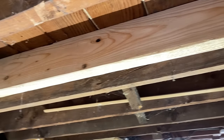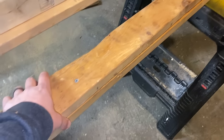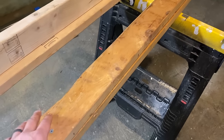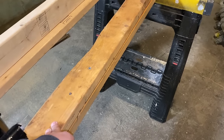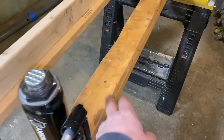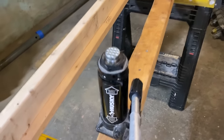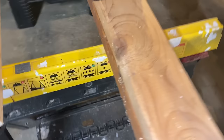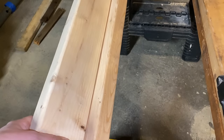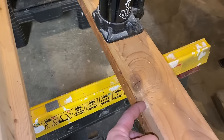So now I'm just going to get it out of the way so we can do a couple other things before we put it in there. What I have here is some pieces I'm going to use to hold up this joist. This would be handy if you were trying to correct a sagging joist. I'm going to basically put this on the floor, measure from here to the bottom of the floor joist, and then put this board on here and support it in the middle. I screwed these two 2x4s together, but this is a better approach if you know you're going to have a lot of weight on the floor joist. This will be just fine.